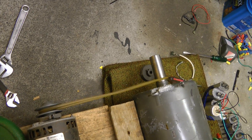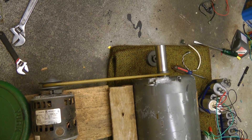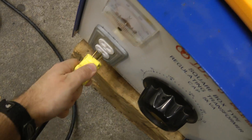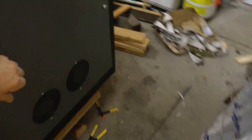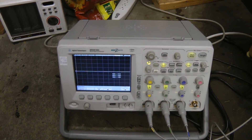A little bit noisy, but now it's up to speed. Let's see if I can plug that into the variac. I've hooked up the three-phase output to the projector's power input, although the other end of the ballast is not plugged in. I've also got three transformers here to monitor the voltage across each of the three phases — those are connected to oscilloscope probes. The oscilloscope is set up over here and I've calibrated each transformer and probe so we have an accurate reading of the voltages.